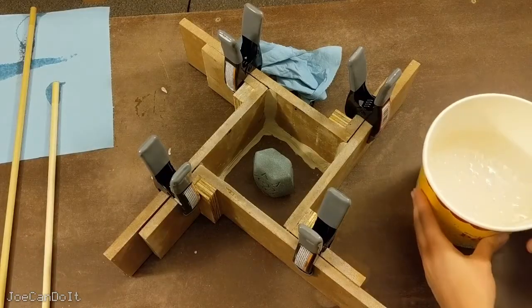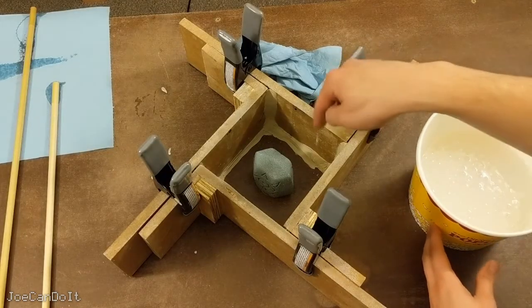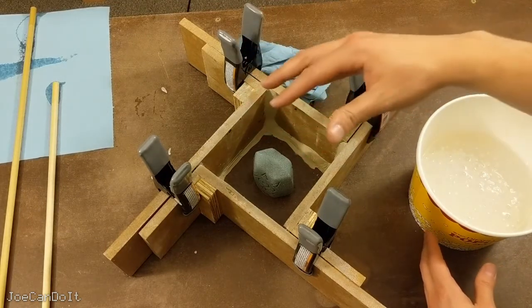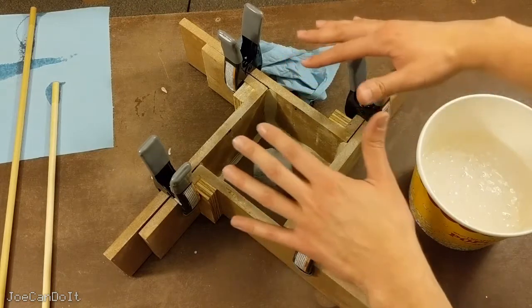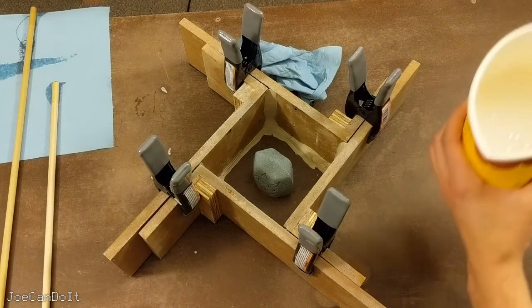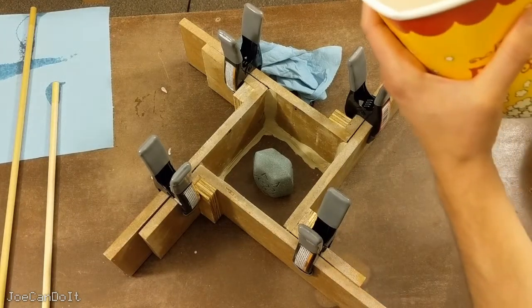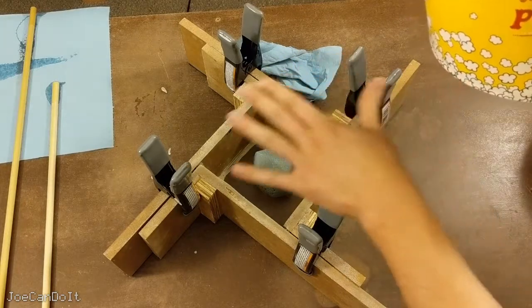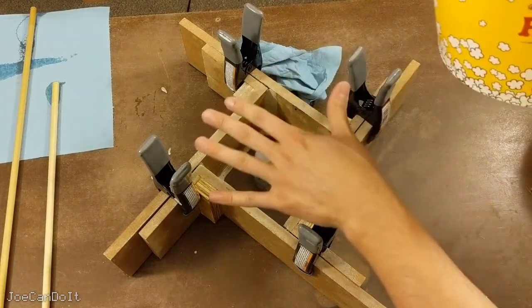When pouring, make sure you hit the lowest level in your mold box — you don't want to pour over the object, as it won't give you an even consistency and may cause air bubbles or voids. When you do pour, try to pour from high up, creating a long thin stream to help siphon out air bubbles so you get a clean and consistent silicone mold.